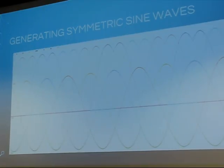And so for practical purposes, it turns out you leave one of them just locked to 0, and the other two do the PWMing, and you get the same voltage from one phase to the next as a full sine wave. People have done this before. People have generated sine waves. This is nothing hugely new, but we're doing it with some cheaper chips, which is a little nice. We have a lookup table to just do that sine wave, and we just get the piece of sine that we need and replicate it a couple times, which is really nice.